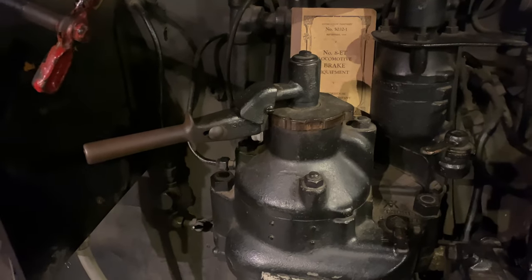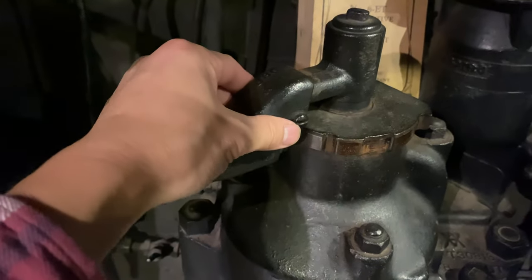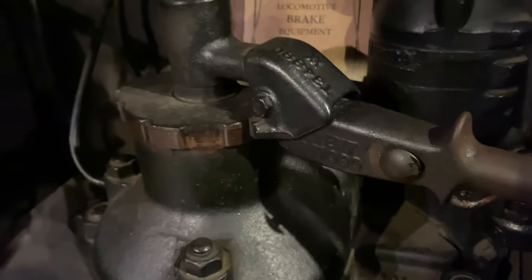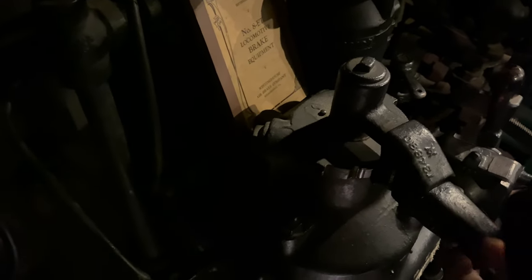We'll start off with the automatic brake. There's actually a part that I guess you could purchase — I don't know if this came with the brake stand or if it was a part you could purchase from Wabco after the fact — but it contains a little notch here that prevents the brake handle from going all the way into the full release position. If I move the handle you should be able to see: all the way up against the end of the quadrant here is your full release position. With this appliance bolted onto the brake handle, we are unable to actually access the full release position.